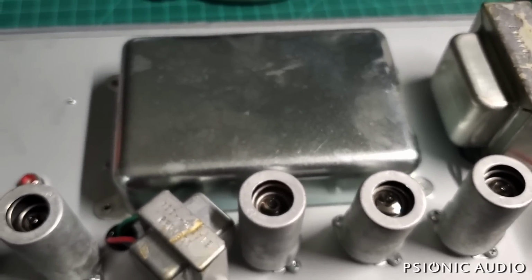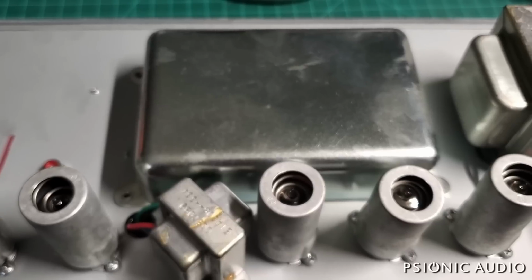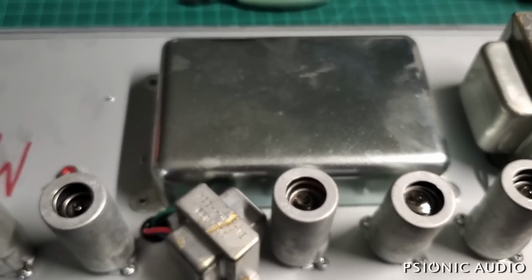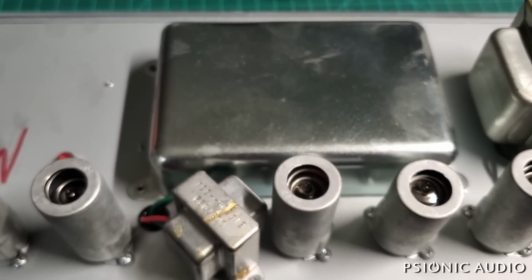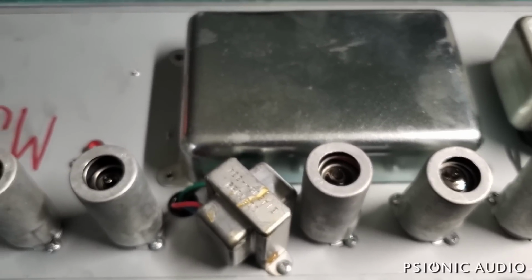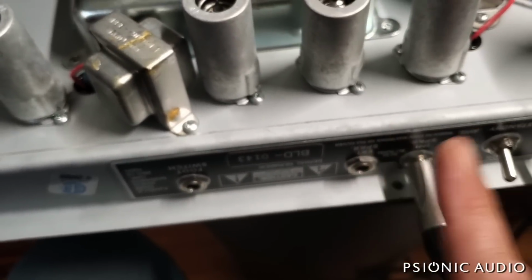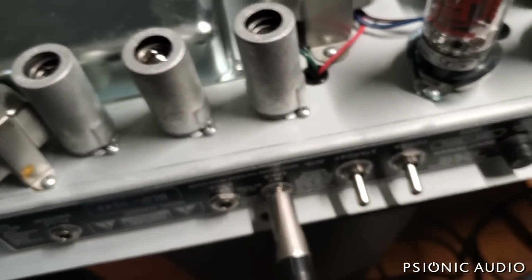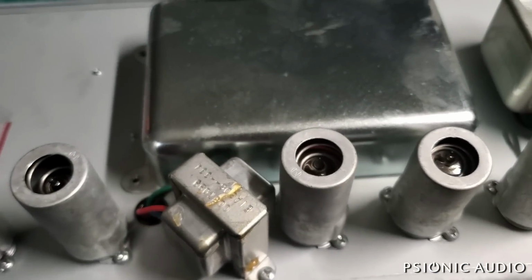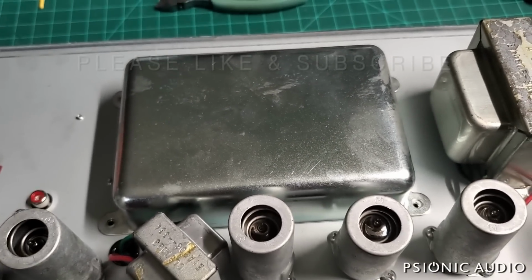I will say that if he had brought the amp in when it blew the first fuse and had not put in the 25 amp fuse, then this amp would not have needed any real repair, just a new set of 6V6s and a bias, which would have been even less expensive. So whatever this ends up costing the owner, that 25 amp fuse made it much more expensive. So I am on his side, even if momentarily he was not.